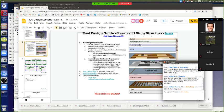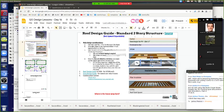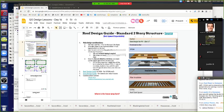Yeah. Okay. So do the insulation box, and then, if anyone else is watching this video, the rigid insulation goes on top of that, so we have to fit that within the insulation box, which means that it's not 16 by 32 feet. It's going to be 16 feet minus 3 inches and 32 feet minus 3 inches. So we'll leave as many of the insulation pieces intact and cut the ones on the edges. Now their pattern has to be such that we want to stagger the insulation so no seams line up. That's the precondition there. So it's like a Tetris thing.